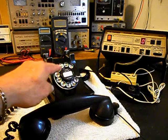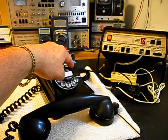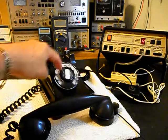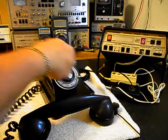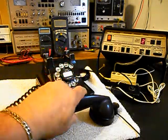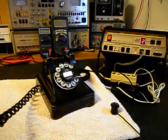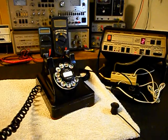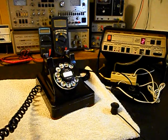Now what we want to do is go ahead and dial our numbers out. If you watch the analyzer, you'll watch the numbers roll by. We have a nice smooth return on our rotary. I'm going to end in a 2. Now I want to transmit into the handset — if you watch that red light on the analyzer, every time you see that red light light up, that's an indication of 100% modulation on transmit. One, two, three, four, five, six.